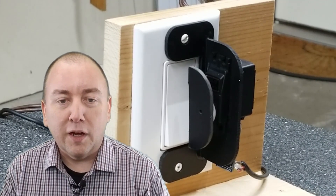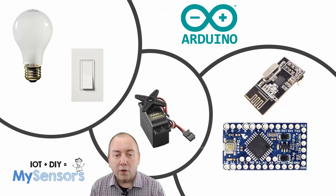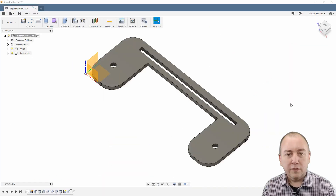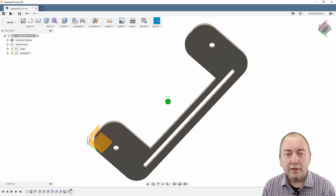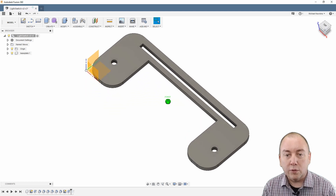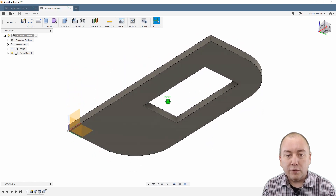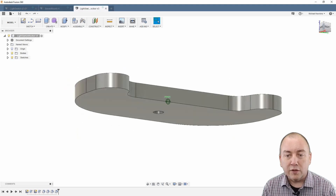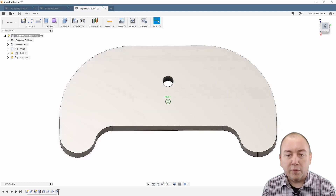For this project, I chose to build a mechanical device that fits over the light switch and simulates a person physically turning on or off the switch. This had a couple of benefits. One, I didn't have to open the light switch and change any wiring. And two, I can still use the physical light switch to control the light, so if the controller goes down — for instance, there's no network for Amazon or Google — my light still works. For the mechanical part, I'm using a servo motor connected to an Arduino Pro Mini. To mount the servo to the switch, I used Fusion 360 to create a bracket. I designed a plate that can be screwed over the light switch cover using the same screws and screw holes. Then I designed a second plate with a cutout to hold the servo, glued at a 90-degree angle to the first plate. Finally, I designed a piece mounted to the servo shaft that acts as a toggle, physically rocking the light switch back and forth. I cut these three pieces from two-millimeter plastic sheets on my CNC.